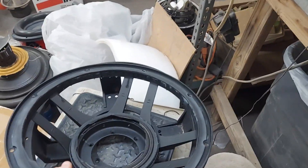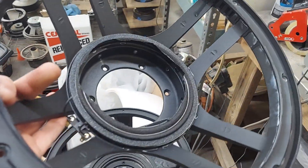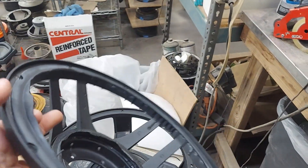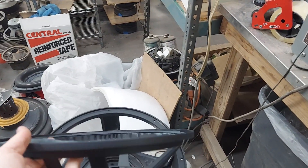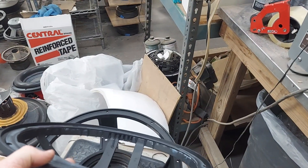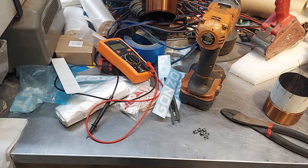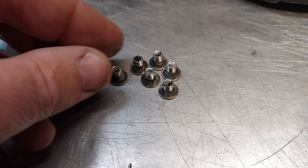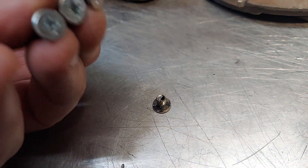The surround's not too big, but then I looked at the spider — they're using a 3-inch coil with a 7-inch spider, which I thought was kind of dumb. The bolt pattern on it is 120 millimeter, which is not standard but it's popular. I've seen it mostly on Sundown on their SA series. Seven-inch spider landing — I'm not a fan. And this is the hardware holding that heavy motor: these tiny little screws, so ridiculous.